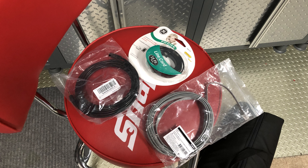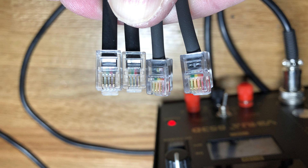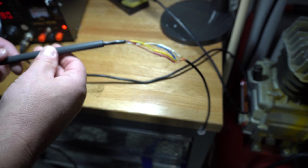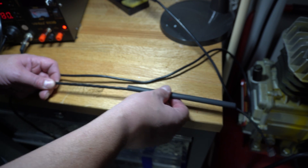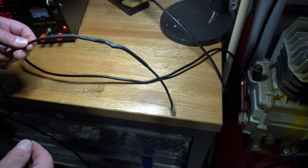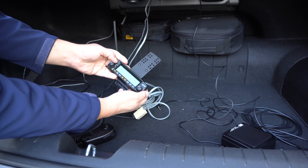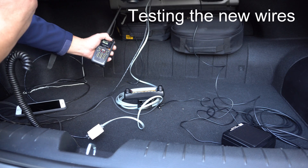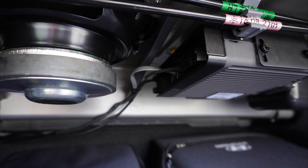When I received the wire, there was one problem: the correct wire for the mic arrived, but it was not the correct wire for the remote control head. I needed to extend the wire that comes with the radio. I tried telephone wire but it doesn't work — it doesn't provide sufficient voltage. So I made a longer extension using a thicker rotator wire, which is a bigger gauge and works properly. I then tested all my cables including the mic, and with everything working I was ready to re-route the wires.